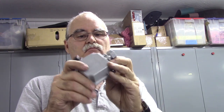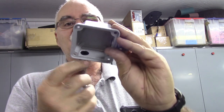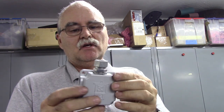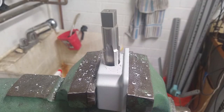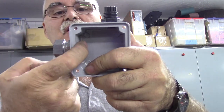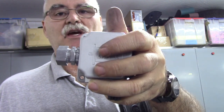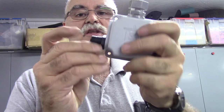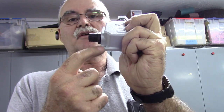The original strain relief is too small to pass this cable through — really small opening in the cap. So I drilled it out using a unibit to 3/4 inch and then used a 1/2 inch pipe tap to thread it. Then I got a standard strain relief fitting, left the lock nut on it, screwed it into the housing so it just barely protrudes, and then tightened the lock nut to lock the fitting in place. I'll use this strain relief to bring the ground wires out and bond the motor right here through the cover.